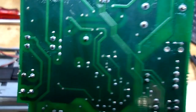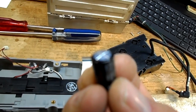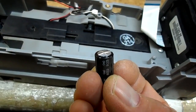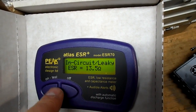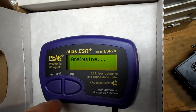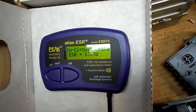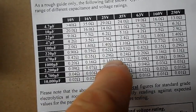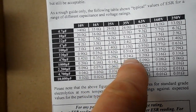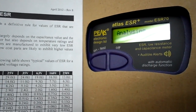The capacitor was pretty easy to pull out. I cleaned the holes, pulled the capacitor, gave the board a couple of taps. Again, there's our capacitor — that doesn't look good. I tested it out of circuit: one beep, no bing-bing — leaky. 13.7 ohm ESR. The spec for a 470 at 35 volts is only supposed to be about 0.24 ohm ESR, so this is definitely not good.